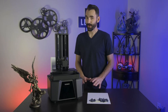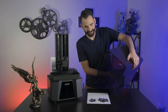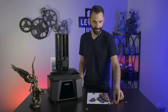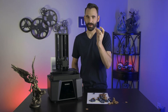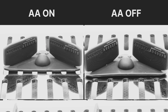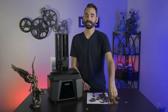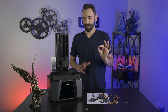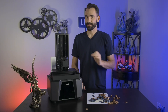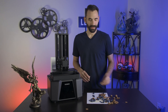To really understand this printer, I ran quite a few calibration tests using the ACF film it ships with and with NFEP. I ran tests with little balls that are about 1.5 mm between the inner shell and outer shell, some anti-aliasing tests based on a modification of Denny Wayne's test, high-detail cubes, and my calibration boxes. But the most important test for this printer is the little flat plates — there are five of them on the build plate. You measure them, and making sure your build plate is level and Z offset is set correctly is very important. Doing this turns this printer from something rather hard to use into something quite fun and enjoyable.